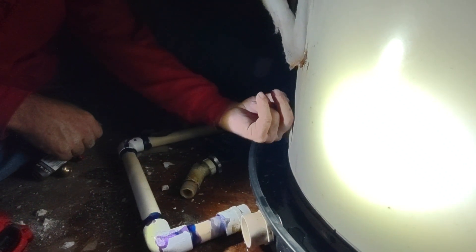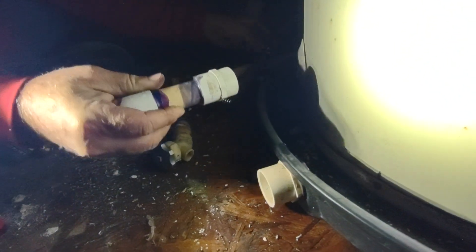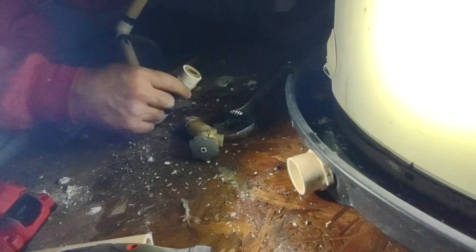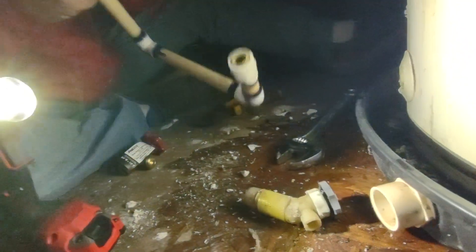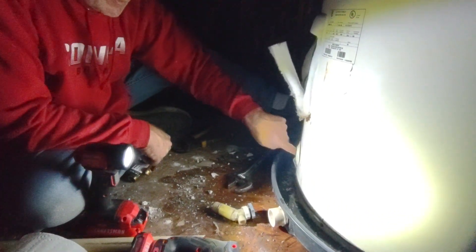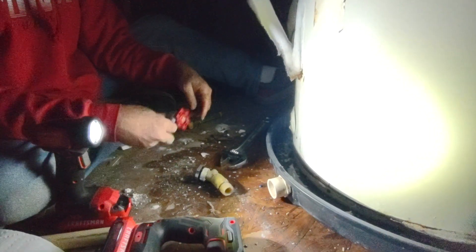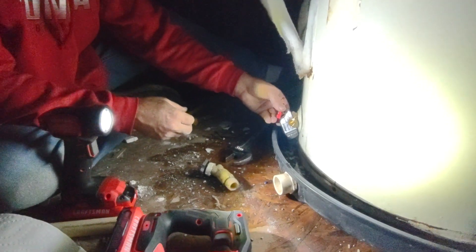So we may still be stuck. You can feel a lot of sediment in there. As you can see, this thing broke — the threads broke off right in the end of this fitting. I had this threaded fitting on my drain line; you can see the threads from that valve broke right off. The bottom of this water heater is just full of sediment. If this thing was outside I would flush it out, but I don't think this is gonna work because we can't get into our threads.